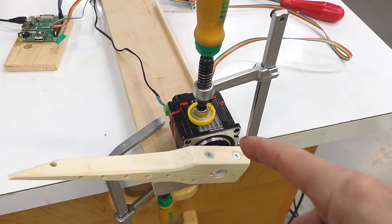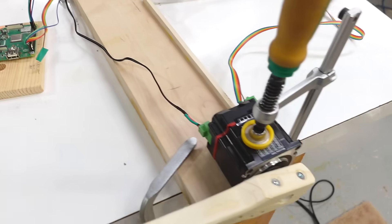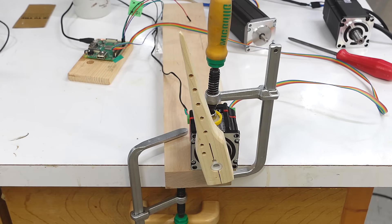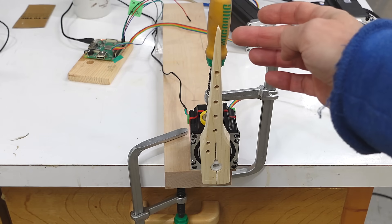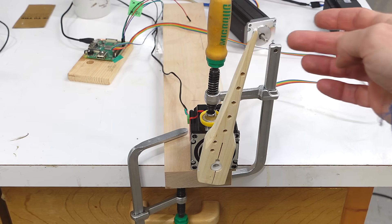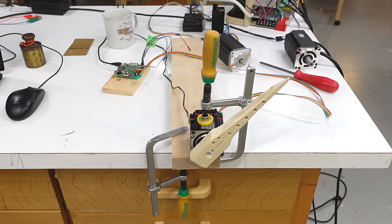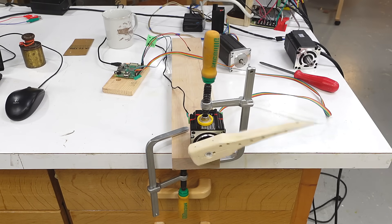Now with this closed loop stepper motor I'm commanding it with pulses from a Raspberry Pi, because pulses is all this can take. I'm setting in all the pulses for the motion all at once so that the feedback loop on the motor has to deal with the motion. You can see it's a bit underdamped because it overshoots, and going the long way around it way overshoots — but unlike the servo I can't change the motion control parameters on it, so it is where it is.